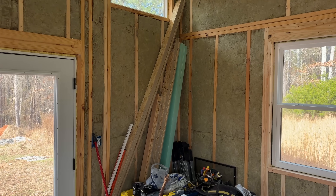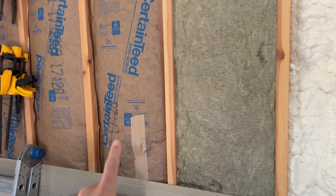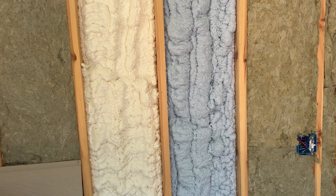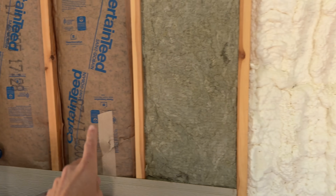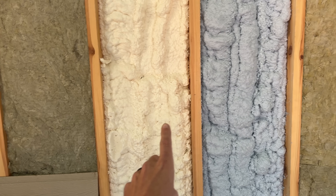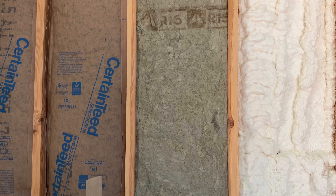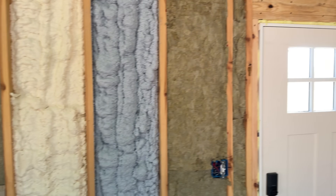On the inside, we tested several insulation options: fiberglass, rockwool, Great Stuff, wide spray, and a Stanley spray foam. Pricing to fill three bays came out to $18 for fiberglass, $40 for rockwool, $120 for Great Stuff, and $150 for Stanley — so the spray foams weren't really in consideration. We went with rockwool for its better insulation factor, moisture resistance, and sound deadening properties, which really makes for a great workspace.